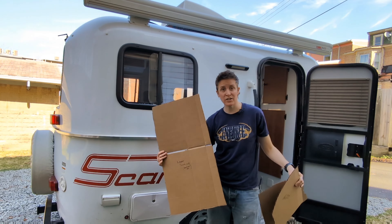Almost 12 inches exactly. Now I have a rough idea of where I want my shelf to be. I need to go cut myself a piece of plywood that is 10 inches wide and 12 inches deep. I've got my shelving piece cut. Let's just pretend these soup cans are the support brackets. There we go — perfect fit. Once the shelf is in place, it's putting tension against these two pieces and keeping the support pieces in place. So I just need to add something right here that'll hold the shelf up, and voila — I've got my first shelf.